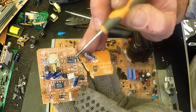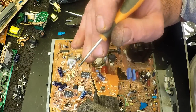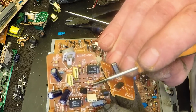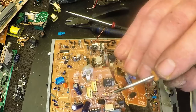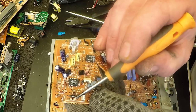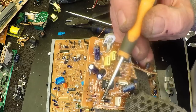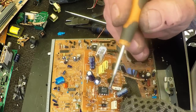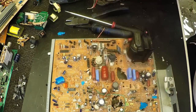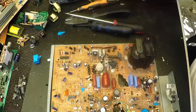On this little board, we're taking off the two IC chips. This stuff — all basic capacitors, aluminium capacitors, SMD kind of capacitors. All these little rainbow things are resistors — no precious metal in them; some might have silver as I mentioned, but nothing spectacular. Not really known for anyone to go for them. And that little black tube with the grey stripe — that's not tantalum, that's a diode. Diodes again don't have any precious metals, some may have traces but not that we're aware of or worthwhile recovering.